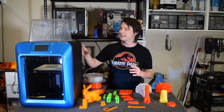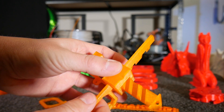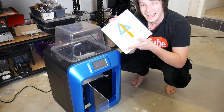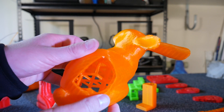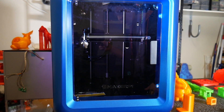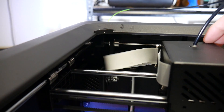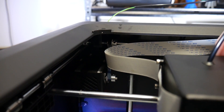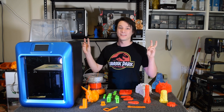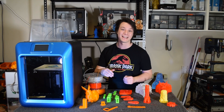At this stage the MakerPi K5 Plus feels about 75% complete. Its printing quality is decent, I've got some really good prints off it, and the removable print bed is awesome. The fact it can do ABS so well is almost a selling point on its own, but that flashy injection molding doesn't distract from the extremely limited user interface, the strange mix of motor drivers, and spotty construction quality. We've all seen how this story goes — 'the unit has been updated and those issues are now fixed' — and this time I truly hope that is the case.